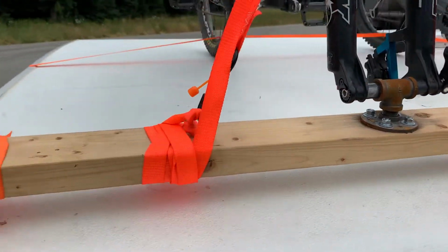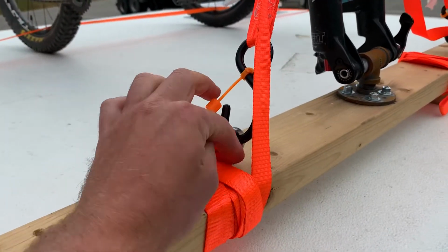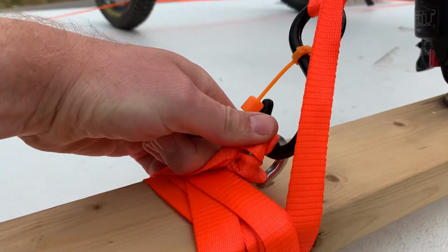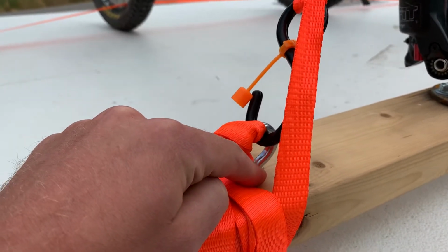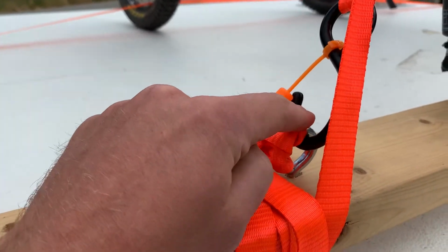Now there are also these eye screws, almost like a lag screw but with an eye end, so like a loop end or hoop end. So what I did, you can kind of see it there, I pre-drilled these. You don't want to just try screwing these in because I guarantee this wood would crack. Pre-drill it, screw that in.